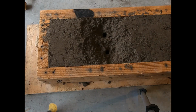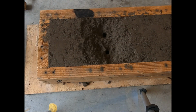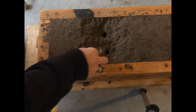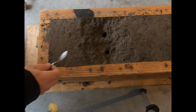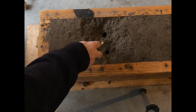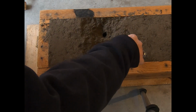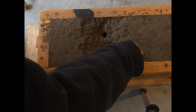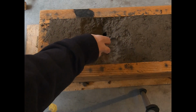But anyway, the reason why I turned this on, and what I want to do in focusing on this spot, is that I want to make a pour basin still. Okay, and so I'm going to build up some sand here to separate these two halves. I'll pour in this one, and then watch it fill on the other side. At least I hope it will. So I'll build up some sand here in a moment. Smooth this out. Okay. Make a wall right along there.